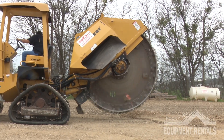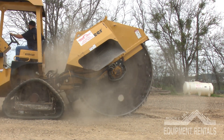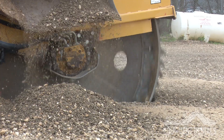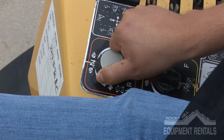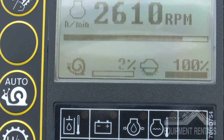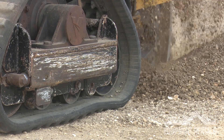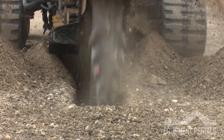Once we have those steps completed, we'll start to lower our cutting blade slowly until we hit grade. Once you get the depth desired, the next step will be to turn the creeper knob forward slightly. You'll notice the speed of the creeper and percentage appear on your screen. At this point, you'll feel the machine advance slowly.